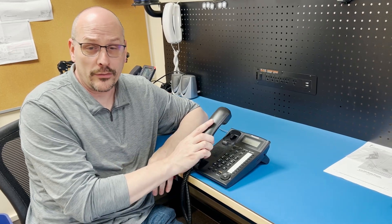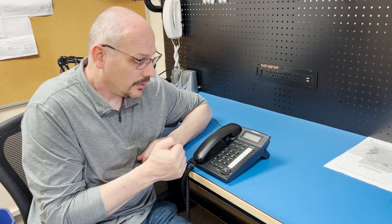There's a special situation on some PBXs where they set up a ring-down, hotline, or auto-dial line, where when the phone goes off-hook it automatically dials the intended number without the ETP 500 needing to dial it. In this case we still need the PBX mode command — star 14 star 3 star — but we don't need the full phone number. We just need a few digits to satisfy logic checks. So I typically use star 13 star 1 2 3 4 star.